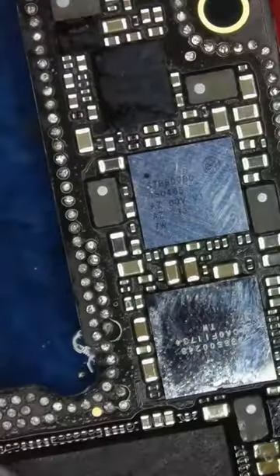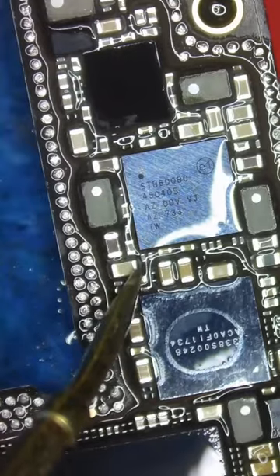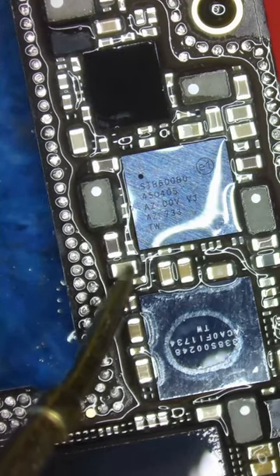We split it in half and check it out under a microscope — I already see the issue. I'm gonna pour some alcohol on the board just so you can visualize this. Do you see that? When I inject voltage into this line, that capacitor starts doing a little dance — it's burning up. I bet that's our issue.